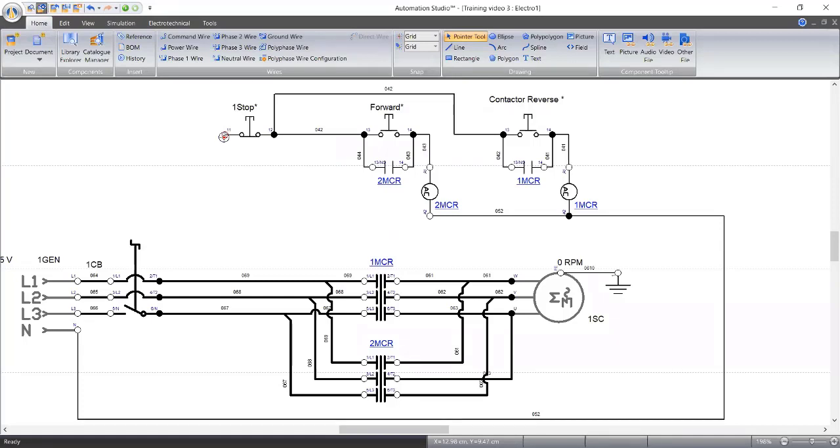If you remember star-delta, you need a timer in between that will switch. But remember, even if they jam in star-delta, it's still the same phase. L1 is still L1, L2 is still L2, L3 is still L3. I don't want to complicate things, but I think you understand what I'm saying. So even if they jam, you won't have an issue. But with this phase reverser, one has to stop. So if you need a relay to stop it, then you need another relay, which will cost you another amount of money.